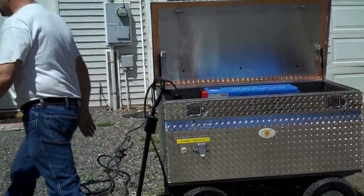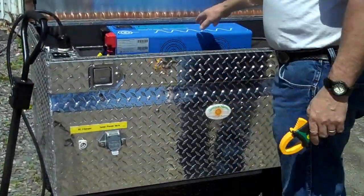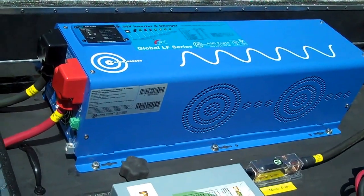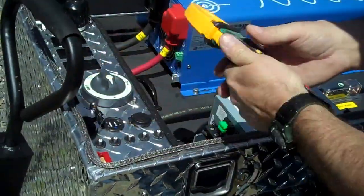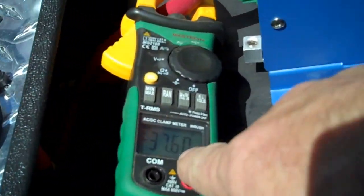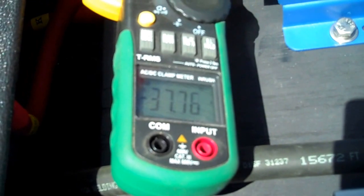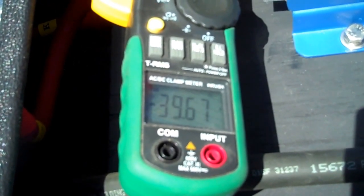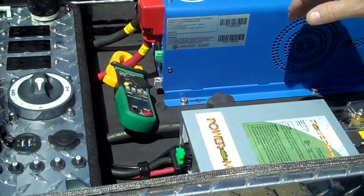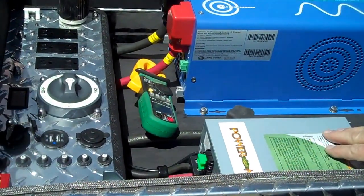I'm going to show how much it's drawing off the batteries. I've got my trusty DC amp meter. At this point, the water pump was on and now it's shut off, so the inverter fan has also shut off. I'm going to clamp it on the main cable here. You can see right now, running the entire house, I'm pulling about 37 and a half amps out of the battery bank. There's no attempt being made to conserve power in any way — everything is on basically. At that rate, she'd run the house about 10 hours. If you were actually trying to get maximum life out of it, you'd shut off everything you're not using and probably run the refrigerators and freezers one at a time, but that's up to you.